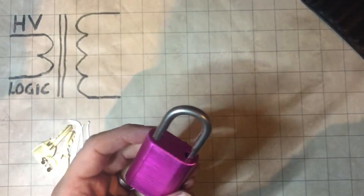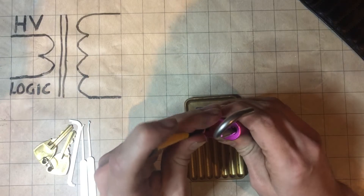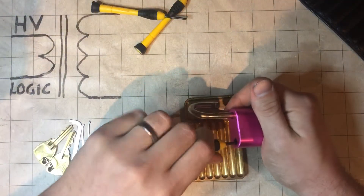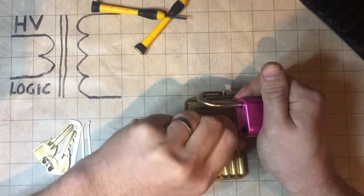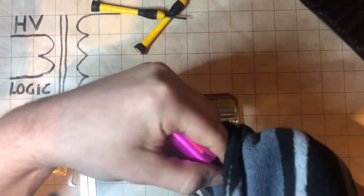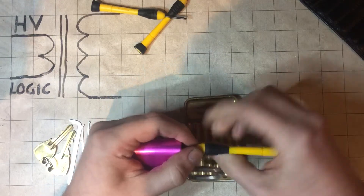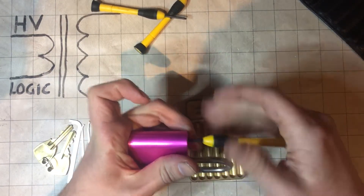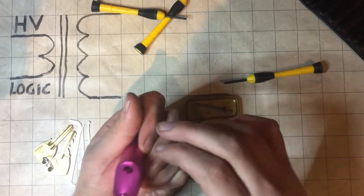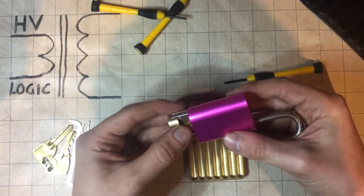Almost don't need to cut it now — having felt what that felt like I can pretty much guarantee what's in there. But got to cut it. It's gonna be a stiff one, probably got a bit of Loctite in there. Hopefully I don't have to get a bigger screwdriver out. Yeah, red Loctite — that's why that was so stiff. Ball bearing as well, so not shimmable.